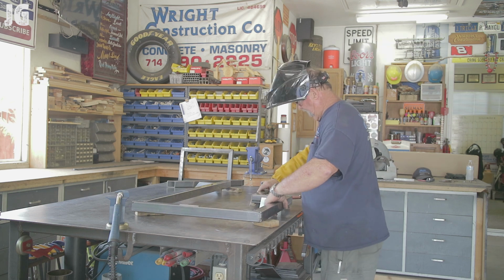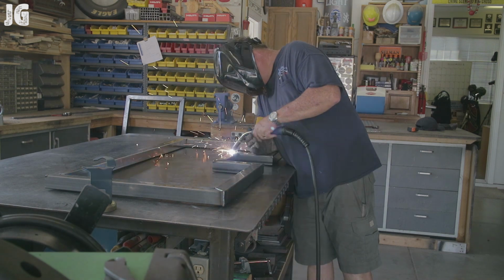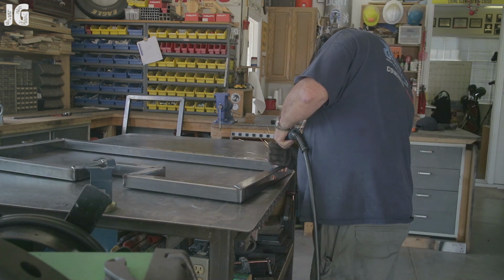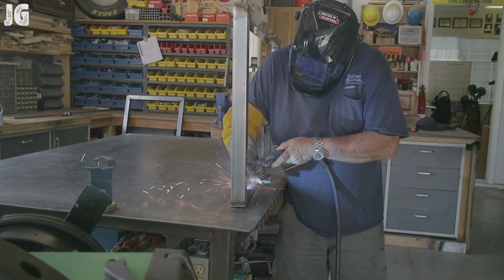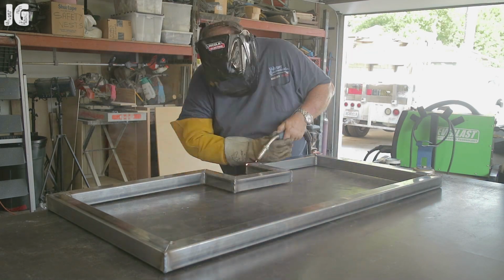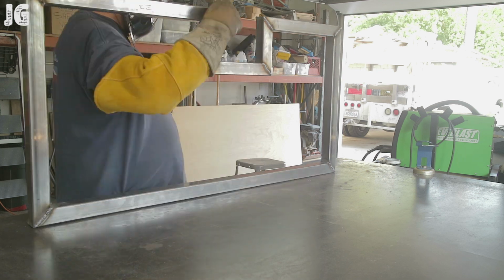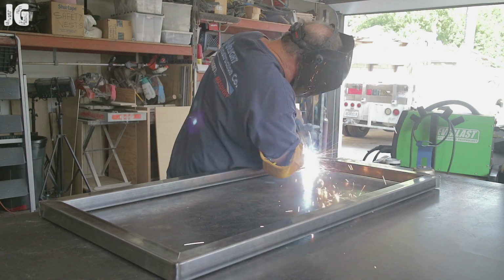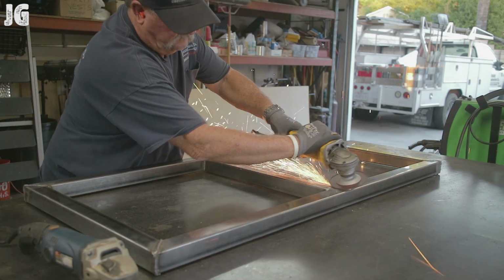And once we did that, get everything just welded out, and just welding and welding and welding, getting every joint welded out. And that's kind of the fun part, I guess. But everything, using this thick wall material, it just stays together and nice and true. There's very minimal warpage, and once you get everything done, the only bad part about this is you're having to grind all the welds that you just did. But ultimately, we got it all done.